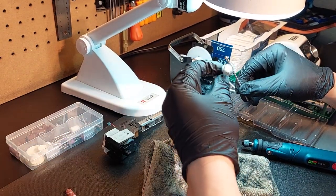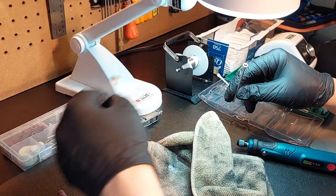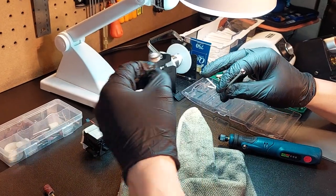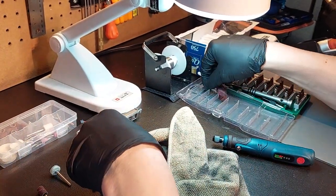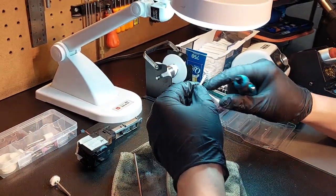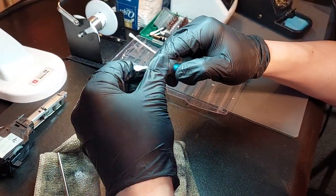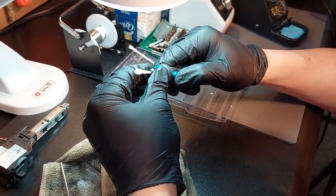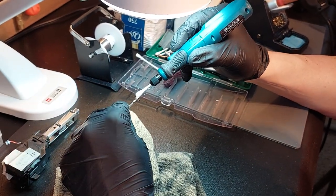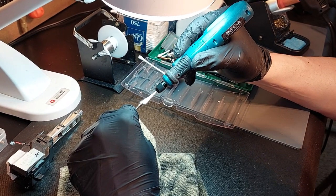And I love these felt components, because these felt polishing components really make a difference if you understand how to use them. A lot of guys use them bare without using the proper polish. I always recommend a polish. Another thing you can check out, and this works exceptionally well, especially in restoration projects like this: Q-tip cut in half, piece of masking tape as a shim. What you're going to do is just loosen up, fit it, and if you want to cut and polish, just don't tighten it too much. Once again, low RPM. You'll hear her cycle down, and now you've got a cotton polishing swab, and you'll really bring out everything in this.